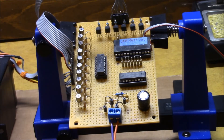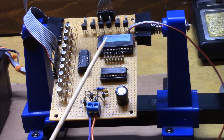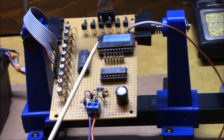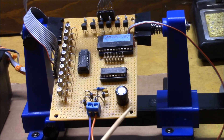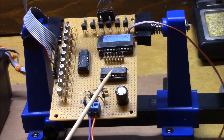Going back to the 5314 — there are other options in the 53-series clock ICs: the 5311, 5312, maybe even the 5313. Different configurations, some of which have BCD outputs that would work here, but those outputs are inverted so you still need an inverter IC — you're not saving any steps or packages. The downside with this arrangement is that the 74C915 is hard to get these days; it's obsolete. The 53-series chips seem more plentiful and easier to find. Just keep that in mind if you're designing something similar.